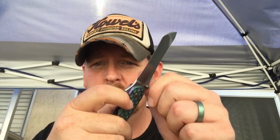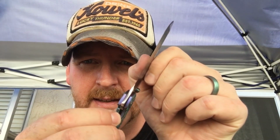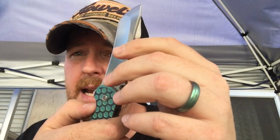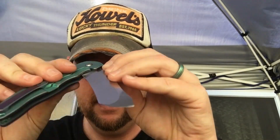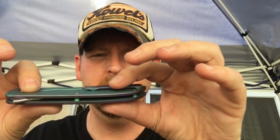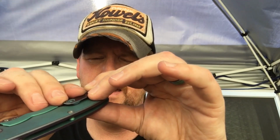The incredible smoothness you get with a Grimsmo Norseman, let me get it past, can also be a danger. This does not have what's called a retard ramp. Once you clear that detent, it just falls. That's what I call it, a retard ramp. And the other thing is, the lock interface on it is so light, because it was so well engineered, it's kind of easy to accidentally disengage the lock. I have done it a couple times just in playing with it. I am going to take this apart and clean it up, I believe. I'm going to talk to the owner and find out if that's what he wants, because I got a bunch of gunk down in it.